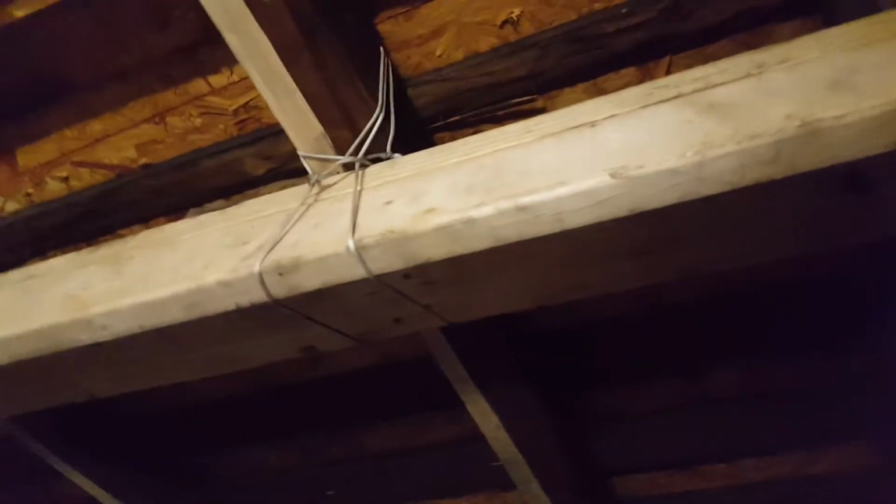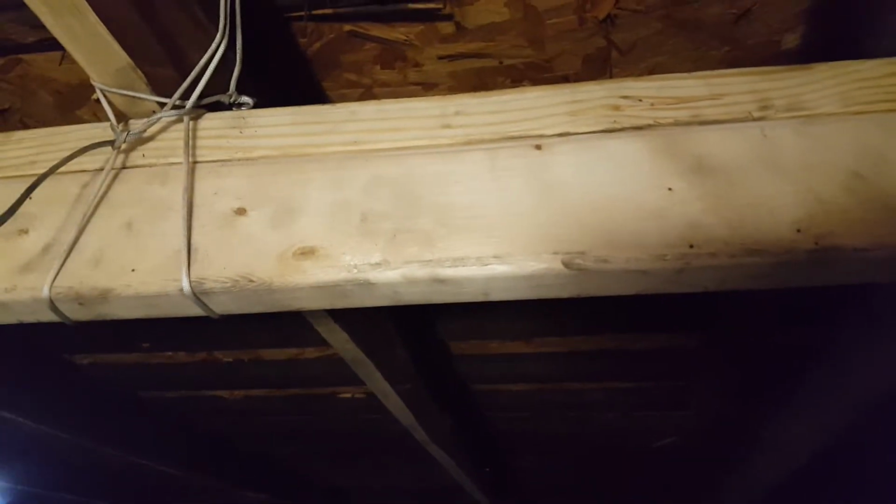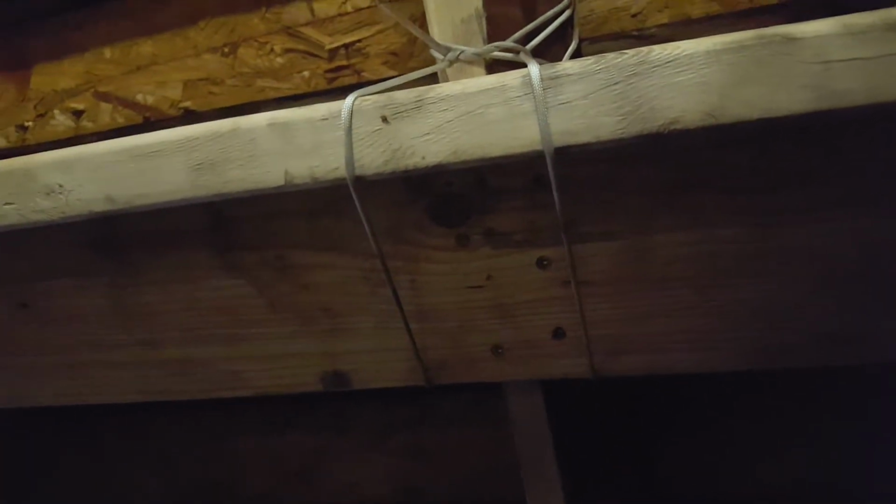And then I came back with this thing, and I've heard it called a trough or a strong back. What is it? It's a 2x8, okay? And I took a 2x8, and then I screwed this 2x4 onto the 2x8. I put screws in it every 6 inches or so. And then I came up underneath. If you can see, I put 5 in that one. Everywhere that they're sistered on, I put 3 in the old one, 2 in the new one.